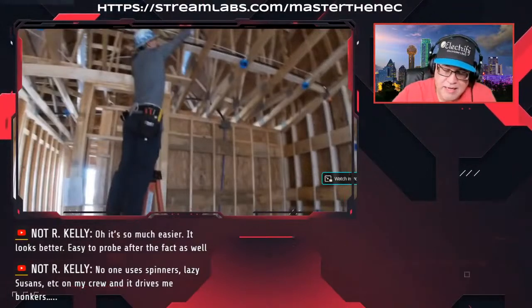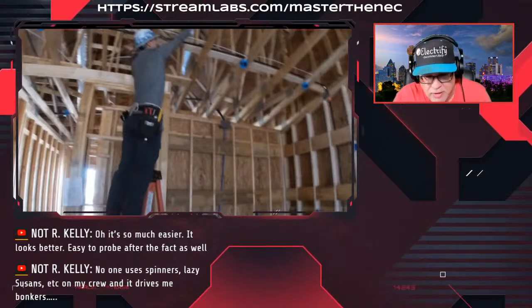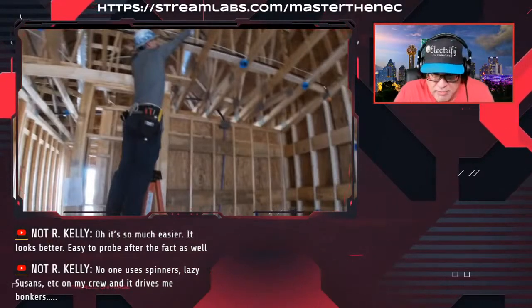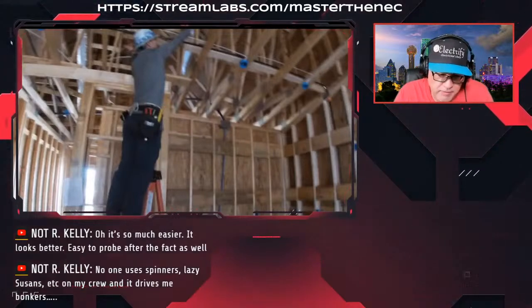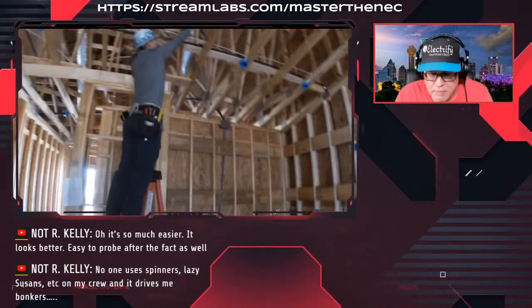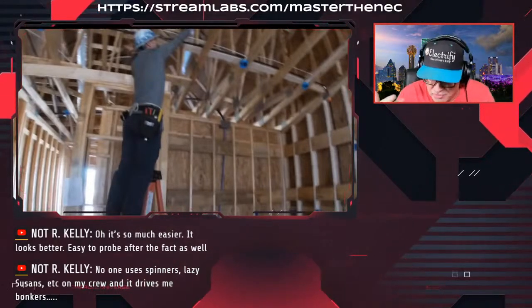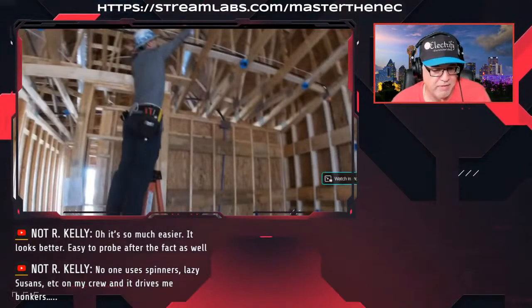And remember, in all fairness, he just looks like he has that one reel of 12 too. So obviously we're talking about pulling multiples. I don't want to guesstimate it and end up being too short. I hate doing that. So you're going to have to do it like he did if you only have one reel. Most of us, when we're wiring, are going to have multiple 250-foot coils of 12-2 or whatnot. But if he's buying one big reel, then he would be stuck doing it just like this unless he guesstimated. And we don't want to have waste, because guesstimate usually ends up in wastement. So the way he's doing it, there's nothing wrong with it. He's using what he's got.